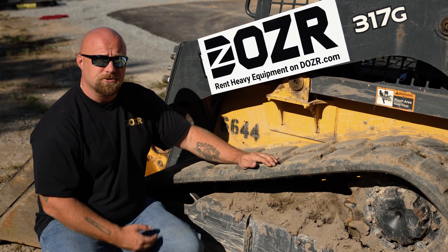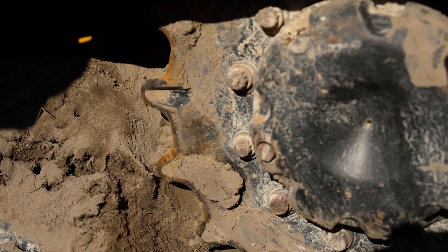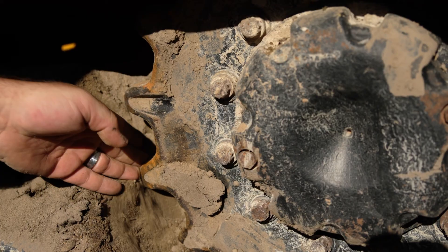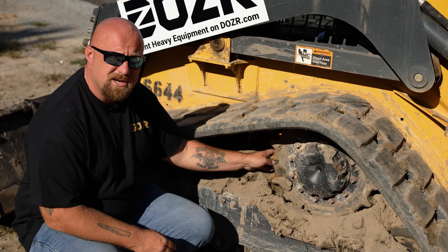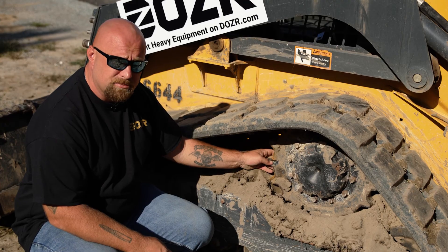After looking at your tires or tracks, move on to the sprocket of the track unit. The sprocket has teeth all the way around which holds the track onto the machine — this is how you navigate forward and backward for your motion of travel. If you see that a sprocket is missing a tooth or appears bent or warped, you need to call in a service call immediately because this will hinder your machine from working correctly on the job site.